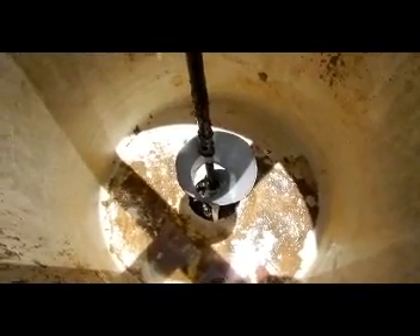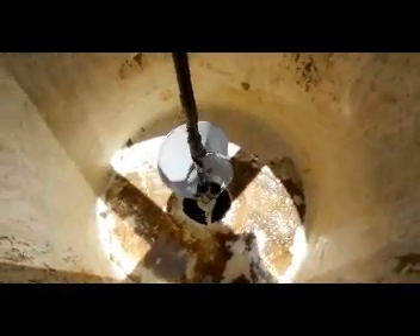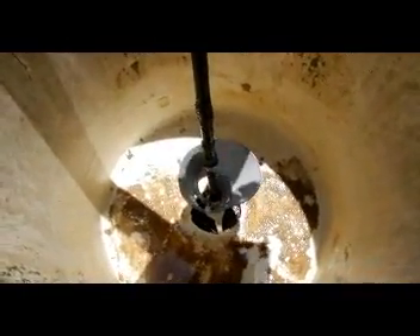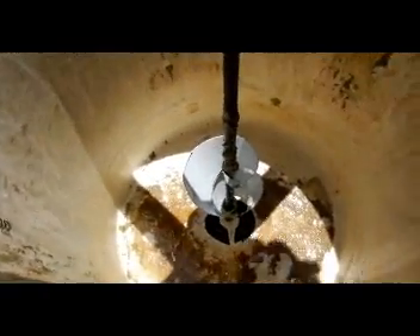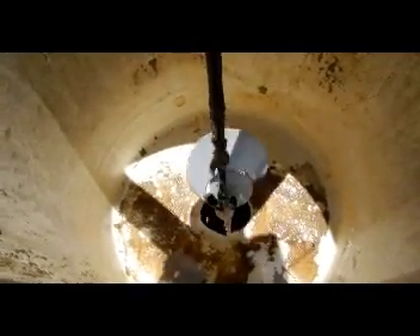At the moment that's sitting at around 180 to 190 RPM. Now if you grab hold of this while it's spinning, you can stop it so easily with your finger, because we're only talking about a small body of water. But if you can imagine this expanded 10 times, where that impeller is actually five feet across, you're now talking about a serious amount of weight in water — tens of kilos of water spinning with all that weight and all that speed. Not only are you exploiting the energy of the speed of the water, but you're also deriving benefit from the gravitational force of the water dropping. You can imagine if this impeller was 10 times this size, the amount of water in the impeller at any one time is significant — it must be tens of kilos spinning. It'll have a high amount of energy to translate into electrical power at the shaft.